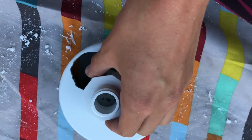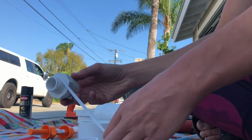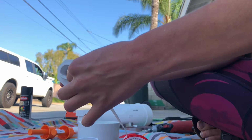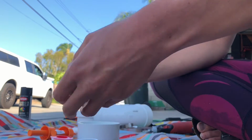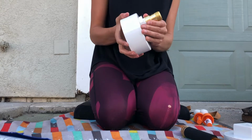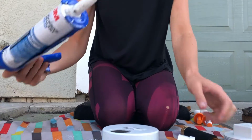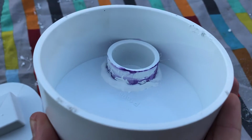As you can see, the hole is not perfect, but the fitting fit, and I ended up going over any of those holes with a marine grade sealant. After that, I went in with some Teflon tape. Make sure you go with the threads that you are wrapping, and then I hooked the spigot to that. After that, I just attached everything using PVC cement and some marine grade sealant. Unfortunately, I accidentally lost the footage of this particular piece, but don't worry, you will see me fitting things together many, many times in this video.